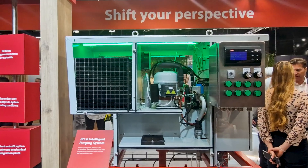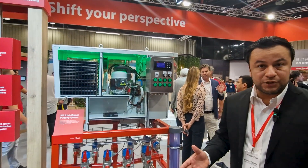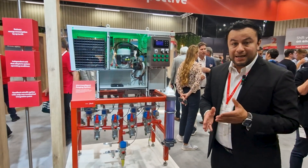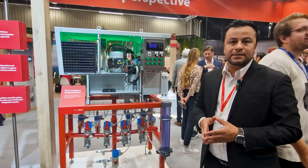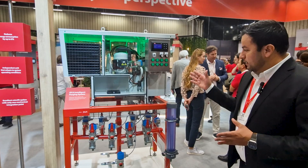The most relevant thing that we have is that from now on, the IPSA is running on a natural refrigerant. It is working with R290 with a very low charge — less than 150 grams of refrigerant. So it is fully equipped and designed to meet the requirements and the demands for the future.